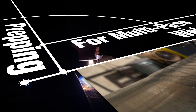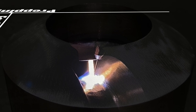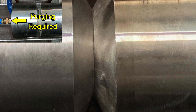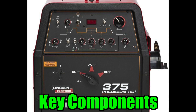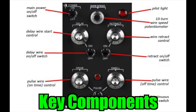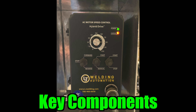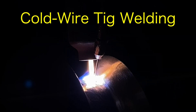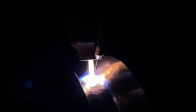Prepping for the root and multi-passes requires proper weld parameters, wire feed speed, and travel speed. The part has a 60-degree bevel with a knife edge butted together and 100% argon for backing gas for purging. You will need a TIG power source, cold wire feeder, and a positioner for this timing technique to be applied. A cold wire TIG process is being used for the root pass and 7 filler passes, after which the following segment will complete the filler and cover passes with sub arc.